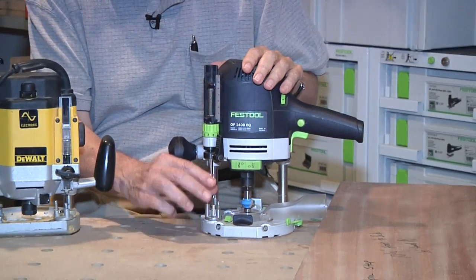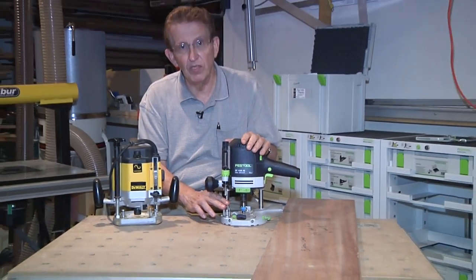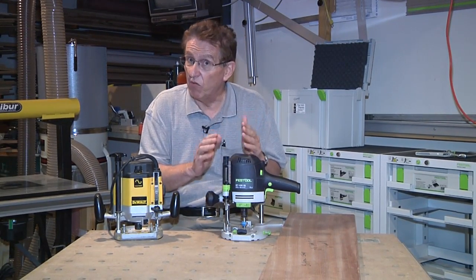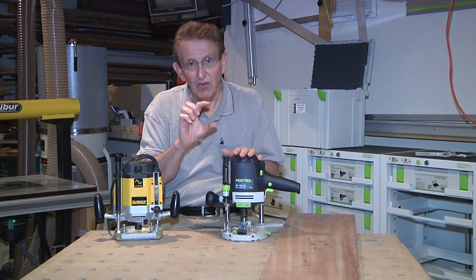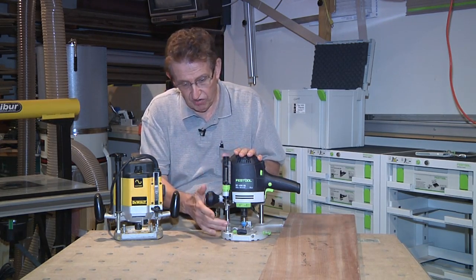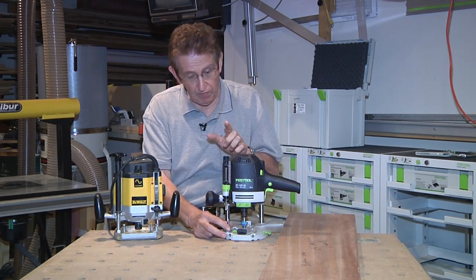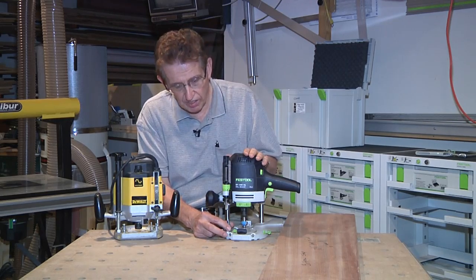Most woodworkers do not understand how to use these things. They think they have something to do with, hey, here's how this bit's set, or here's how that one is. In reality, the bit settings are controlled very much by the depth to which they're inserted in the router, and thus you can't really memorize anything between sessions with these. They're used strictly for depth adjustment while cutting. How do you go about using the things?